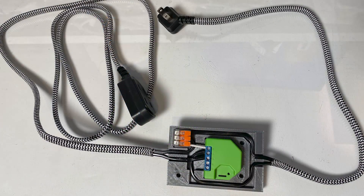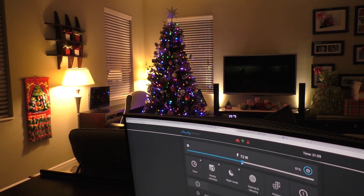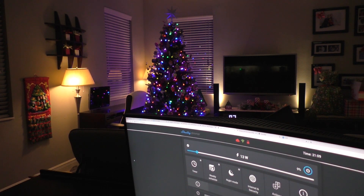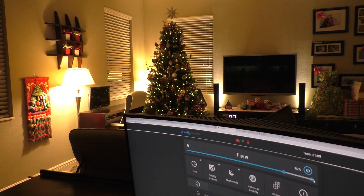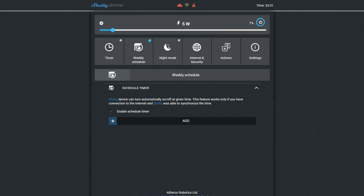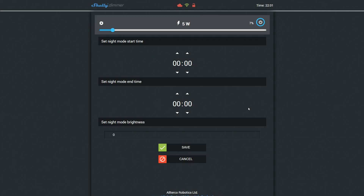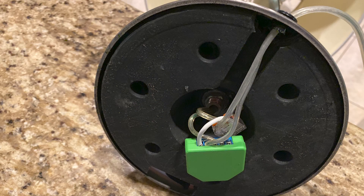Now I have a portable, WiFi-controlled, dimmable circuit that can dim all the lights connected to it at once. I'm using it in my living room with a floor lamp, a desk lamp, and two uplights that turn on every day as ambient lighting around dusk. From about 5pm to 7pm my family is still really active so we like the lights at full brightness, but after my daughter goes to bed and we settle in for the evening, we want the lights more subdued. Since these lights aren't connected to a switched outlet, dimming them would require 6 smart bulbs — or a single Shelly Dimmer. I'm regulating the dimming level based on time of day in Node-RED, but the Shelly app also allows for dimming schedules and a night mode where brightness is automatically adjusted based on the time of day. If you're only trying to dim a single lamp, the Shelly Dimmer is actually small enough to be installed in the base of a medium-sized lamp.